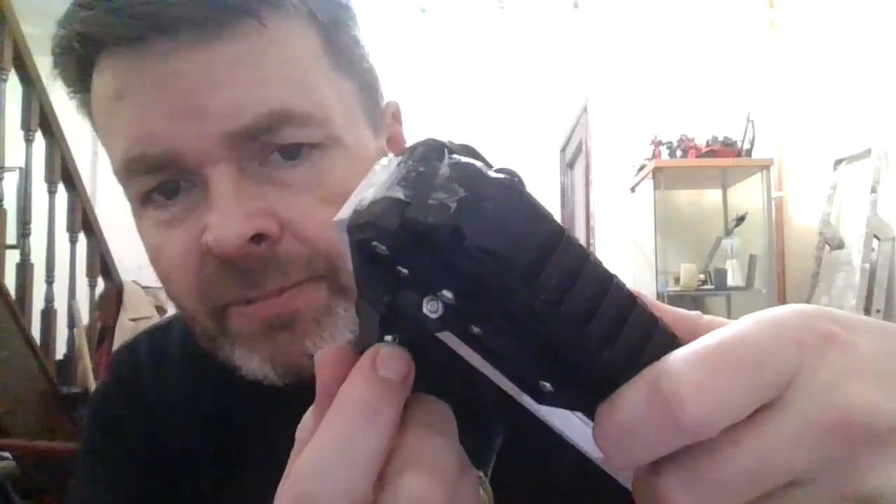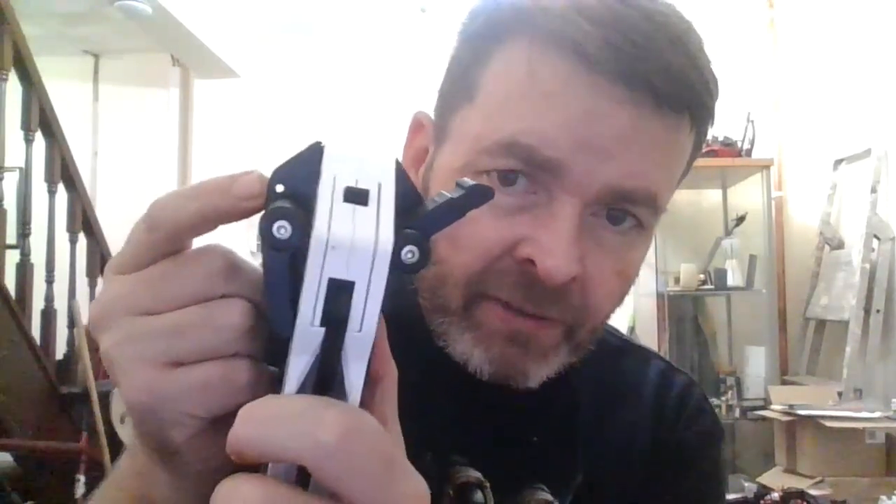You put your cams on first. The screw here is a little tiny grub screw that locks in the arm, and the grub screw diameter is too large for the hole. If you try and lock it in while it's in place, you give yourself very limited room. So make this hole bigger before you fit it in. Once the cams are locked in, you have a good solid lock.